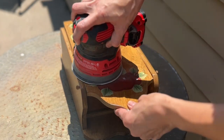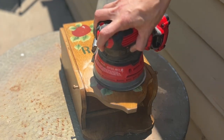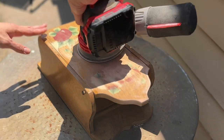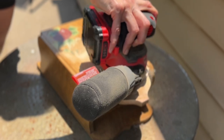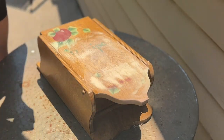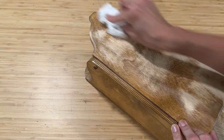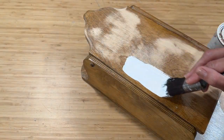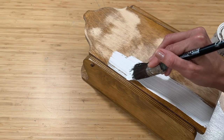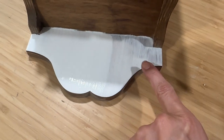I began by sanding this down. I have 220-grit sandpaper on my orbital sander, and I wasn't too worried about a perfect sanding pattern because I knew I was going to paint over this part, but I did want to remove the image and the words so it didn't show through my paint design. Once back inside, I wiped the whole thing down with a little bit of dish soap and warm water, just in case it had any residue left from being a kitchen piece, and then I'm going in with my one-step paint. This is DIY Cottage Color in White Linen. It's an all-in-one paint with a built-in sealer, so there will be no need to seal it before I move on to my stencil.